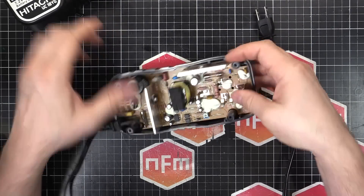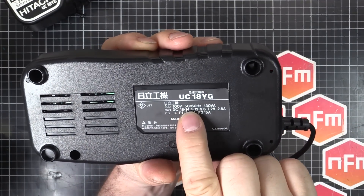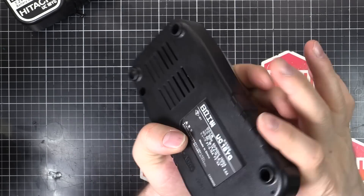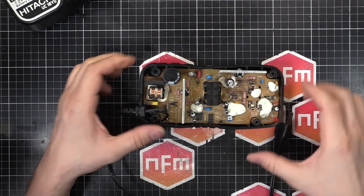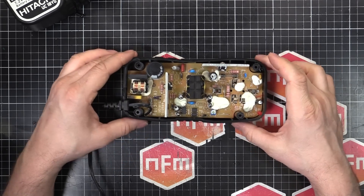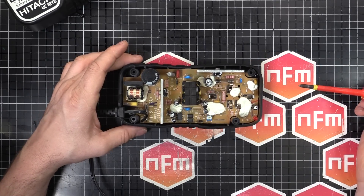You've got to be careful because this one — if you look on the bottom — is only 100 volts, 50/60 Hz. We've got both frequencies in Japan for historical reasons. It's not universal voltage. I guess if it's only being sold in 100 volt countries, they're not going to spend the extra money on high voltage capacitors and whatnot. You can save a few cents per unit and that adds up.